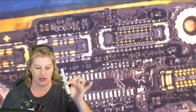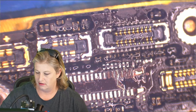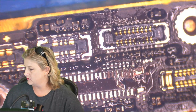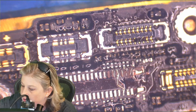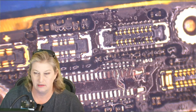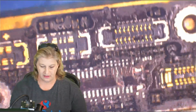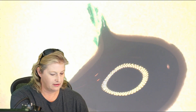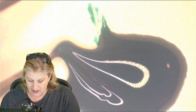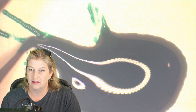So we're going to put on the UV curable solder mask and cure that with UV light. This is essential stuff that everybody should have that's doing board repair. You can find it on iPad Rehab Supply at iPadRehab.com. I'll show you how I use this — I'm going to put some on a little post-it note, just squirt it out of the syringe. Then I'm going to use a very fine edge of my BGA tweezers or even just take a piece of hair and drag it through here to get as fine a paintbrush as you can.